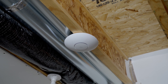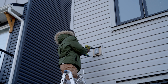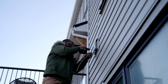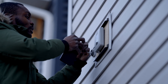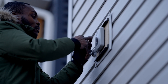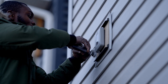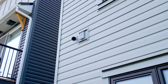Now let's proceed to the security cameras and doorbell installation. During the build, I got my brother to tell the builders to run Cat 6 ethernet cables to the front and back of the house and another for the doorbell location. Unfortunately, he forgot to mention the one for the doorbell, so we proceeded to install the UniFi G4 camera at the front and back. I terminated the cables with outdoor-rated shielded RJ45 connectors. One thing the builders failed to do was to use outdoor-rated cables for this exterior run. Although it's not a big deal, I made sure to embed all the cables inside the wall during the camera installation, leaving no parts exposed to the elements. The UniFi G4 Pro is an outdoor-rated 4K night vision camera with a 109-degree field of view, capable of providing full coverage of the entire backyard and front driveway with a single unit each. It's also PoE powered, so the UniFi 24-port switch supplies both data and power through a single cable.